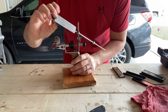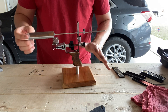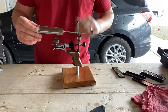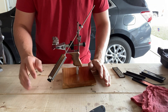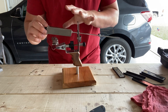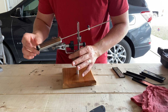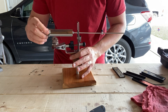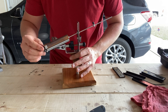On these diamond plates, if you're going to do finishing strokes — I did a video on the aggressive edge, or 'refined bite' is probably the better term — I said light pressure stropping strokes. Depending on the steel, the stones, and the grit, you can get away with different stuff. But on these diamond plates, I think it's really important that if you're going to do these finishing strokes, to do them very light — less than the weight of the stone holder — these light stropping strokes to try to knock off and reduce that burr.